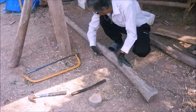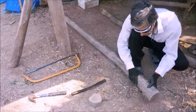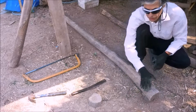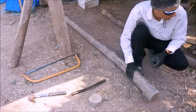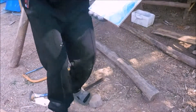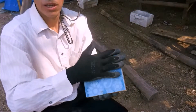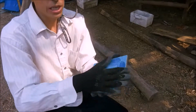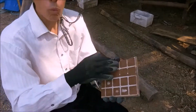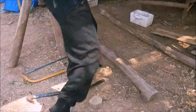You can see how the whole pole's been raised up off the ground — there's going to be less termite activity. I've now got a small area where I can inspect for termite activity. You're not going to stop termites. I've got a final trick up my sleeve for termites. The best thing is to get pieces of metal — tin lids, biscuit tin lids, sheets of metal, ceramic tiles, bathroom tiles, bits of weather board, fiber cement sheeting — anything that termites won't eat.